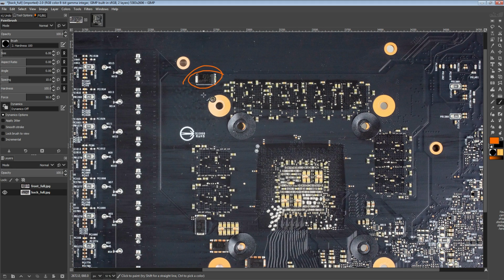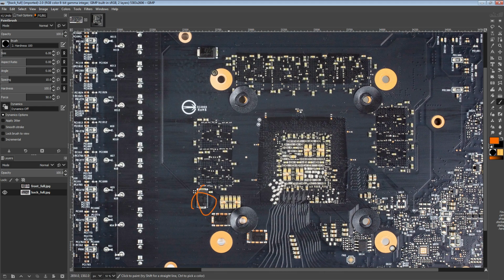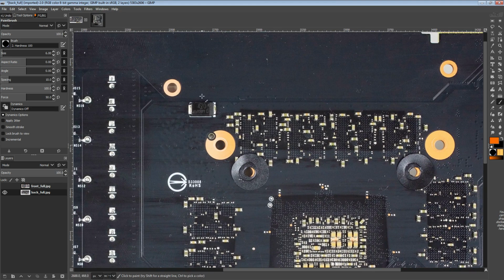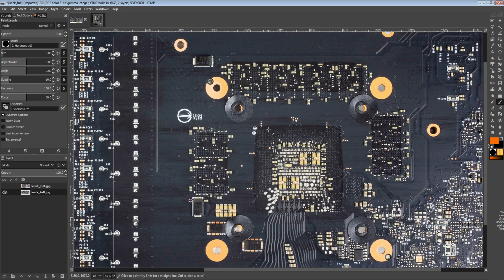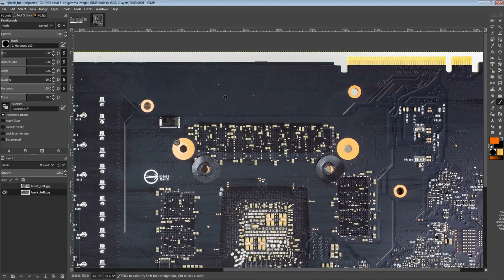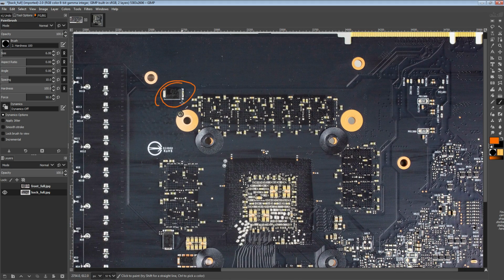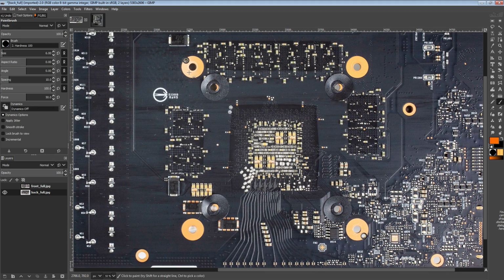I guess this works. It's basically my observation that MSI is doing this on the memory power plane. Though I've not checked if other cards are doing this, so I'm not sure if this is a requirement or if MSI is just doing this for memory overclocking improvements. In theory, the main benefit would be that you could clock the memory a bit higher, if this is different from what you'd see on a reference card. Though, judging by the review of this card, that doesn't seem to be the case.